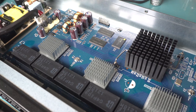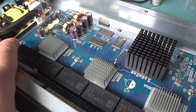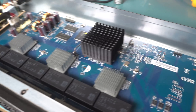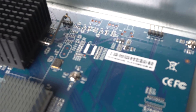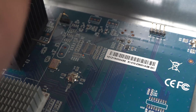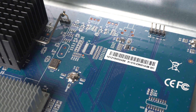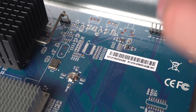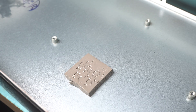I've done a power-on test to make sure the power supply is working with the replaced cap, and I've also checked the fan headers. This one is outputting just straight 12 volts. The other two are outputting nothing, presumably because they have components missing and are probably intended for a tachometer and transistors to turn fans on and off — so those two fan headers are totally dead. There's also a decently sized thermal pad underneath the main CPU, so watch out for that when removing the main board.